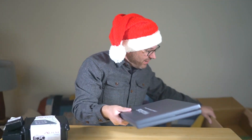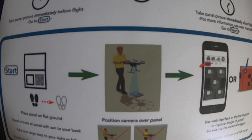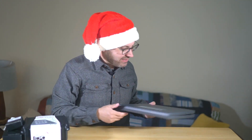Then we have the all-important calibration panel. You still need to calibrate your imagery. If we open this panel, you can see a nice white reflectance panel. You set this down, hold the drone over it, take a picture before you fly. When flying time-series data to look at change in vegetation, you really need the lighting conditions — the amount of light bouncing off the plants — to be the same, so you calibrate with a reflectance panel to compare apples to apples over time.